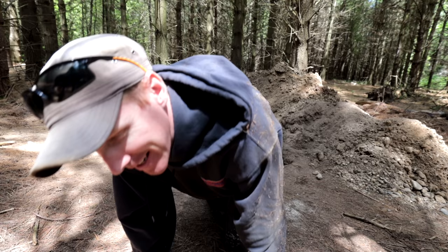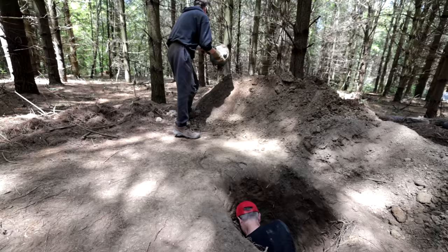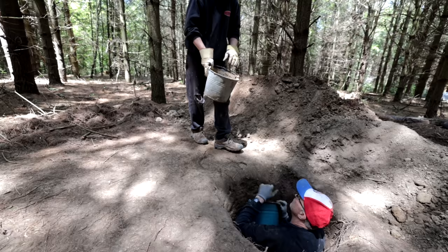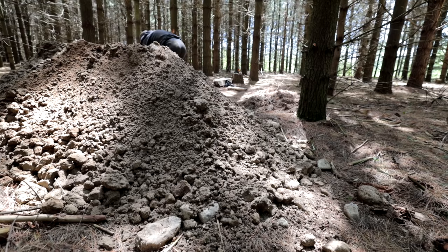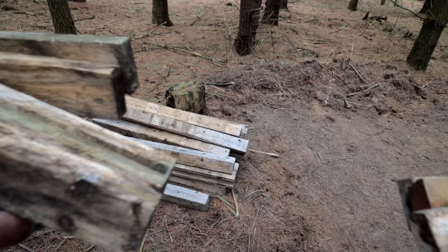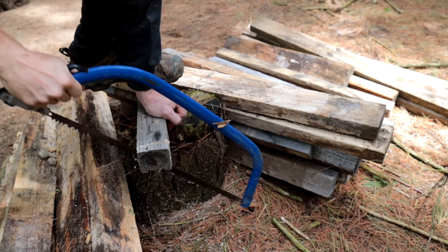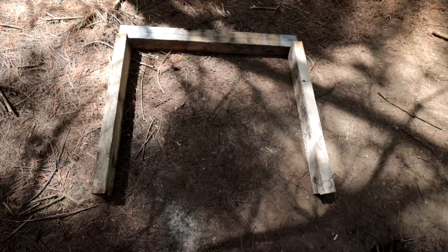We're tunneling horizontally and want a space around six feet long to comfortably lay down. It has rained significantly over the last couple of days and we haven't experienced any collapse, but we're going to start cribbing. The plan is to take cross members and put horizontal pieces with uprights on the sides to stabilize the dirt above us. I'm using old square-cut timbers — a top horizontal piece supporting the ceiling and two sides. My sides are a bit long so I need to cut them first to make them all the same size, with the width predetermined by the horizontal pieces.